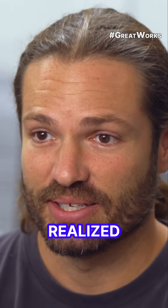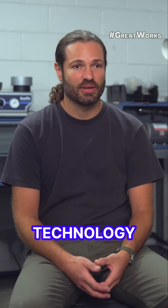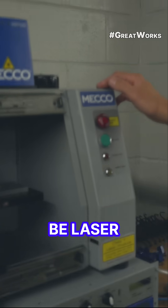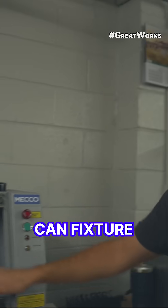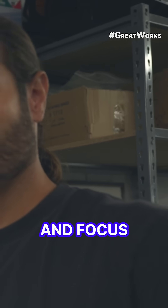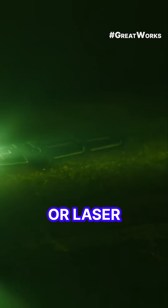One of the first things I realized when visiting Swiss watchmakers was how much technology had been adopted into the watchmaking industry. A little higher tech over here would be laser marking. On here we can fix your parts on this table and there's a laser up here. When the laser beams come in and focus, that focal plane is where we can actually remove metal. So we can do a deep laser engraving or laser cutting.